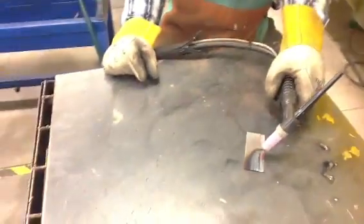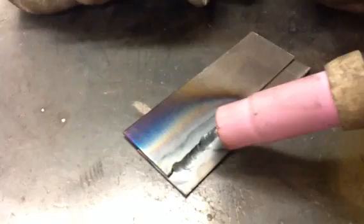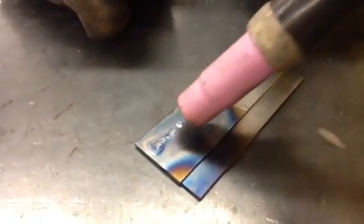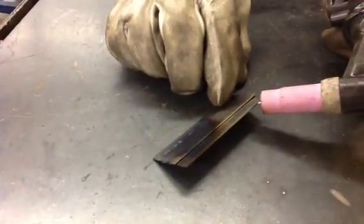And I'm going to stop right there so we can take a look at that post flow. What I'm looking for is some uniformity. I got real nice uniformity through the second part there — you can see I was waving a little bit, but it didn't move too much either. I didn't have to spot the other side. Looking at the other side of it, we've got pretty much max heat penetration. I'm getting away with using the table as kind of a backer because that one piece is on the cold table, so it's not typically going to burn through. But where you see those spots right there, if that was sitting up in midair it might burn a hole right through, and we'd have to dial it back or use even less heat. We'd want you to weld this full through all the way from one side to the other. You can flip it over and try the other side, and then we might do something with a filler rod as well.